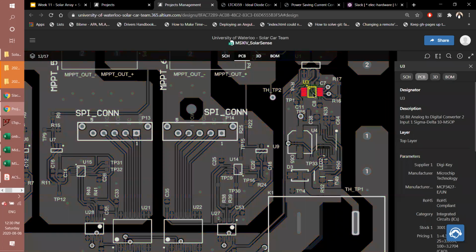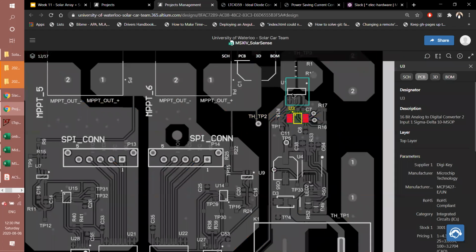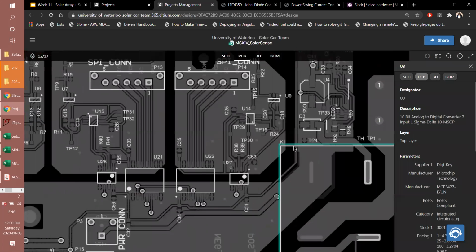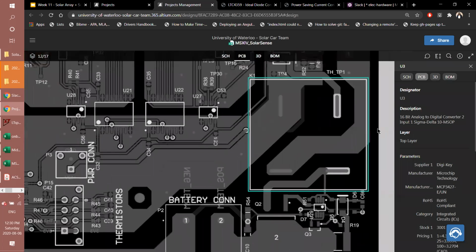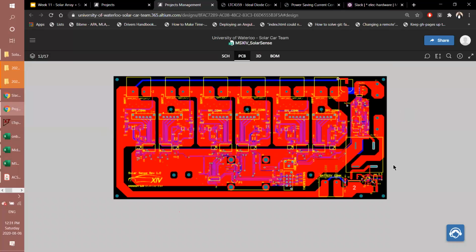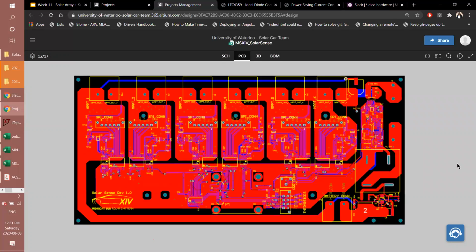But then we have our solenoid driver, the economizer. We have our ADC. Actually, this ADC is for the Hall effect sensor. We'll look at that later. But that has to be on this side of the relay where the coil is. And then we have the main power path, which circles around the board. That's because the main power path has to reference both terminals of the battery connector. And this is the nicest way to do it from what I was playing around with the layout.